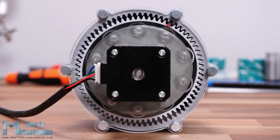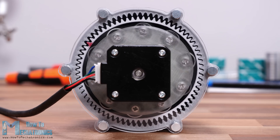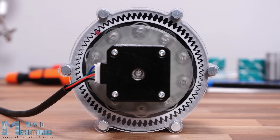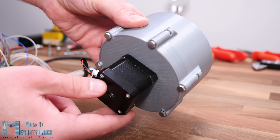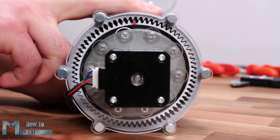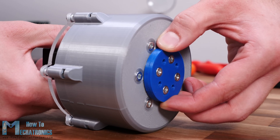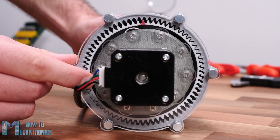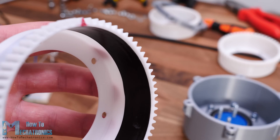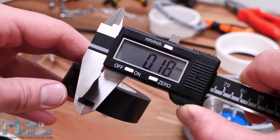To be honest it's quite fun looking at how this thing works. However we can notice that the flex spline sometimes jitters or the motion is not that smooth. There are several reasons for that. In this particular configuration the problem is that I made the acrylic motor mount by hand, so the motor is not mounted perfectly in the center. When using the original 3D printed motor mount the movement is much smoother. We can also notice that our harmonic drive is far from having zero backlash — that's because of the limitations of this type of 3D printer. It's not just about how good the tooth profile can be printed but also how accurate the overall dimensions are. For example, I used an insulating tape on the inside of the flex spline which is only 0.18 mm thick and with it I got better results.